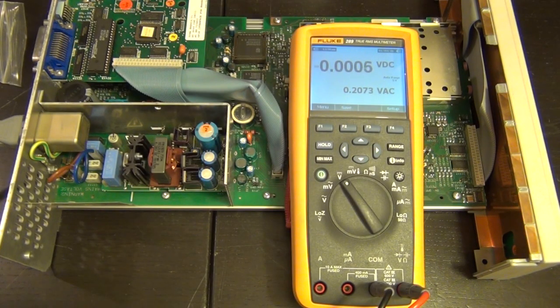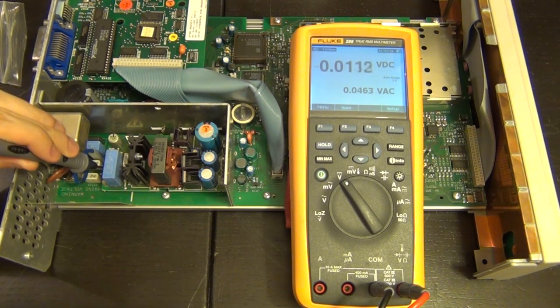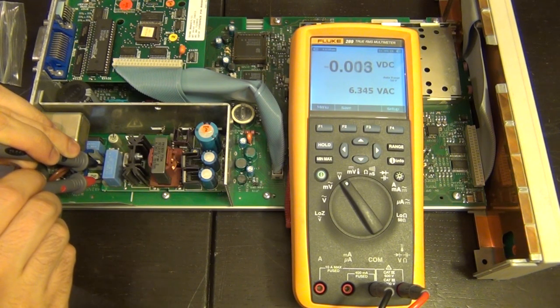Alright, this thing is plugged in, and I'm just about to measure the voltage after the rectifier to confirm, hopefully, that the rectifier portion is okay. I apologize for the noise, it's extremely annoying, but there's really nothing that I can do about it at the moment. So let's go ahead and very carefully probe that. I'm going to probe the negative terminal over here, make sure I have a good solid connection with my hand, and the other one over here. And then I'm going to look at the multimeter.